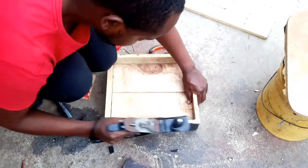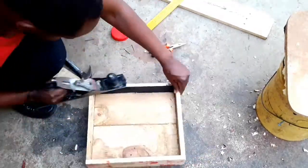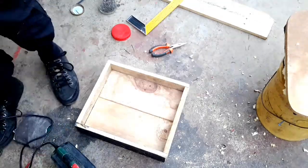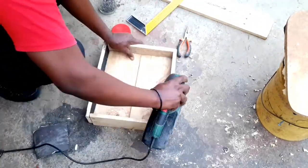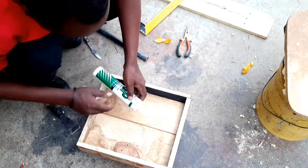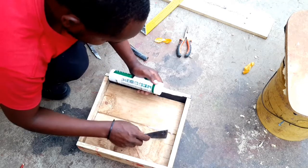With every step, remember to polish off any rough edges you might find on the sides. To level things up you can use a hand planer, but if you don't have one, use sandpaper and repeatedly sand the pieces that are sticking out. I also used an electric sander, but again you don't need one — just use sandpaper.